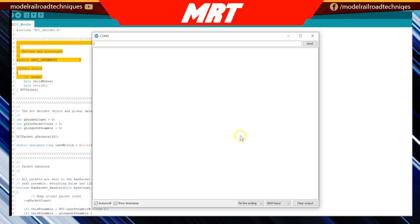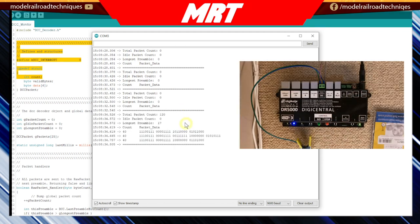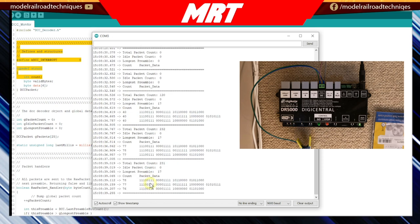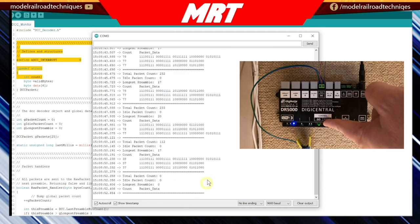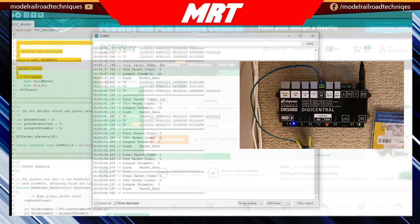Let's give this little board a test. Here we've got the Arduino IDE. The sketch running is a DCC monitor. You can see in the serial monitor at the top of the screen that there's no DCC turned on. Now I've turned it on — you see the ones and the zeros, which tells me this board is working as it should. When I turn the system off again, you can see there's no DCC signal coming through and the system goes into idle.